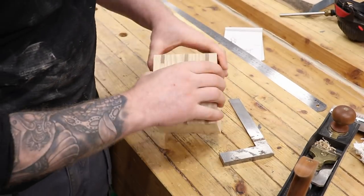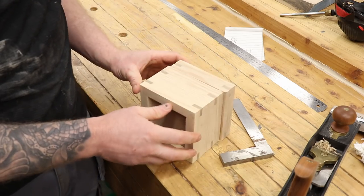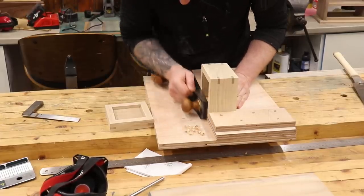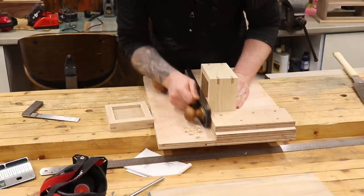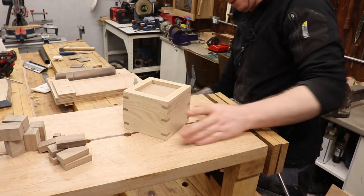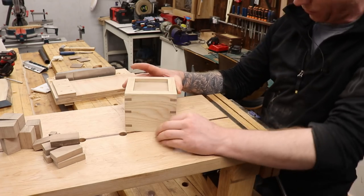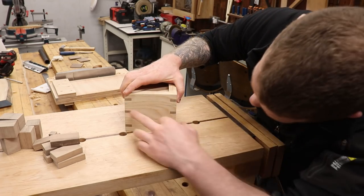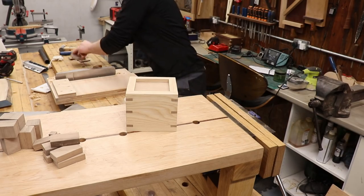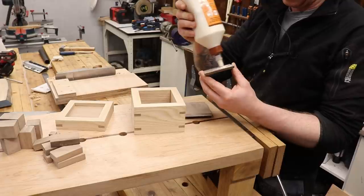We took a shot and it didn't quite work out — it's not perfect the whole way around. We have a slight gap because I had to do it in two cuts, a little bit more here. That's what shooting boards are for, so we'll finish this up on the shooting board and get it fitting nice and flush. We recovered from that almost catastrophe — that was a bit of a dumb move cutting that on the mitre saw, I won't be doing that again. We've straightened everything up on the shooting board — the edges aren't too bad. I'm not going to go any more than that — don't want to remove more material or the box will get a bit small.